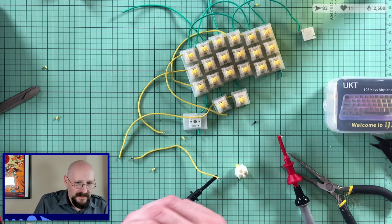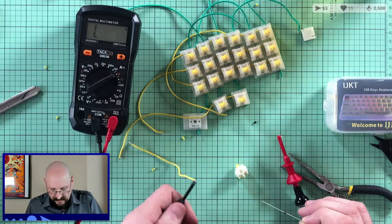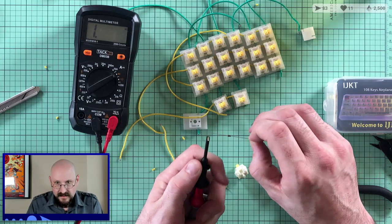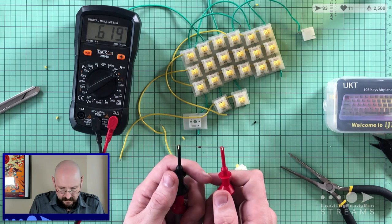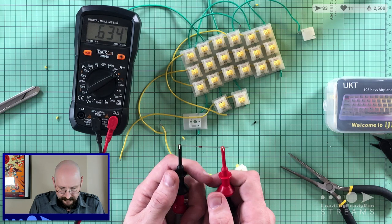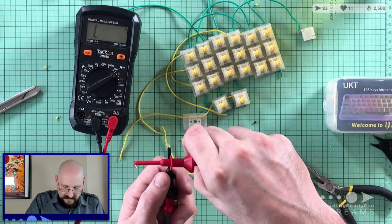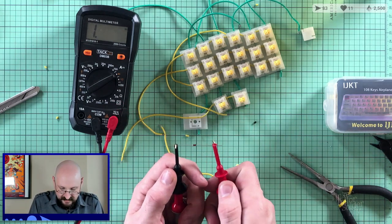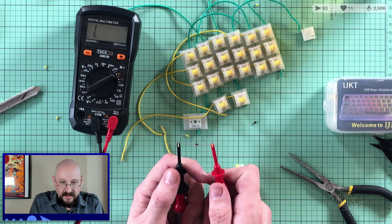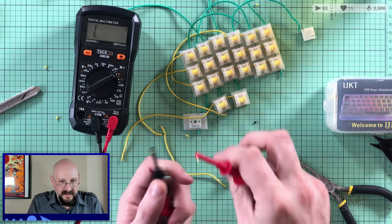When using diodes, the meter shows the forward voltage on the diode. That's a good question, yeah. What's that like there? One and two. 0.634 in that direction. Other direction, diode black to the left. Nothing. So that seems right, yes. Okay.